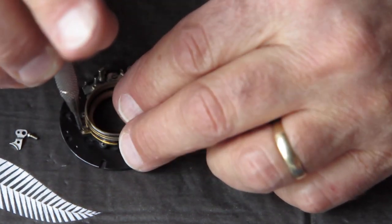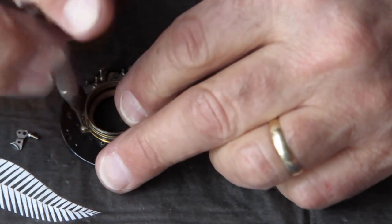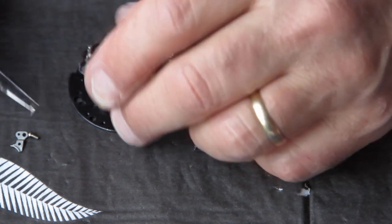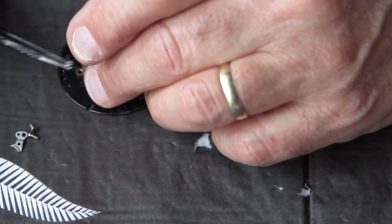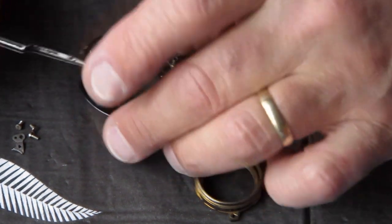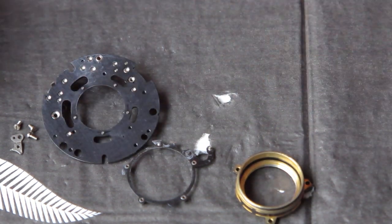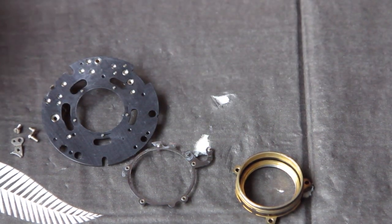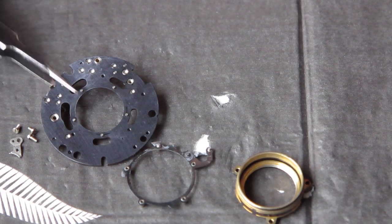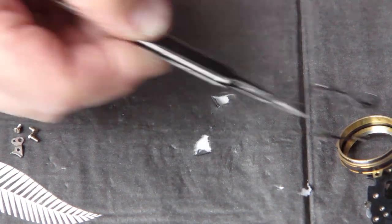If you mix the screws up, you'll end up with a shorter screw where the bracket is, which means that if you're over enthusiastic tightening it, you'll end up stripping it out because it won't extend all the way through the mechanism plate. And if you end up with a long screw where the short screws should be, it will stick through the mechanism plate, do up nicely, but jam the shutter when you go to operate it, as the blade's hooked behind it.